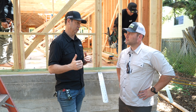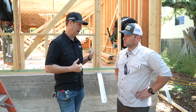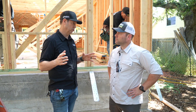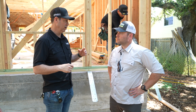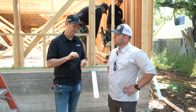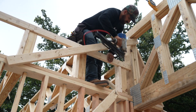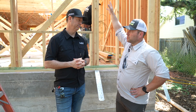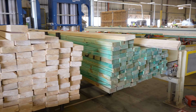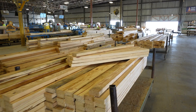It's also a happy medium on cost. This is a very affordable package, and we did spend more time ahead of time thinking about how things went together. Builders First Source has a bunch of digital tools to help figure out routing later. All the trusses have been pre-thought — both roof and floor trusses — accounting for where the HVAC system's going and where plumbing intersections will be. It's not just that the wall packages come out; they work together with the truss system. Everything — floor trusses, roof trusses, all the walls — comes from Builders First Source as a full computerized system, so you can see exactly what you're getting before anything is produced.